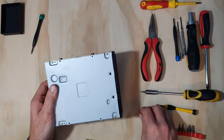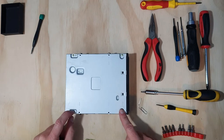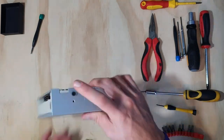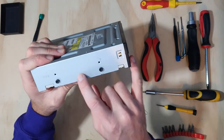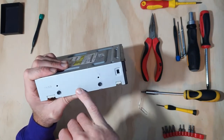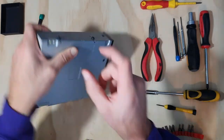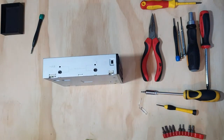But for now, let's have a look at the screws. These four screws are pretty straightforward. There's also these two here — one here and one here. There's actually a helpful label here: M3 times 6. This would be a metric screw — it's size 3 this way and size 6 this way, probably 3mm and 6mm.